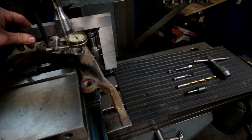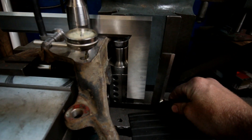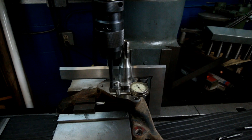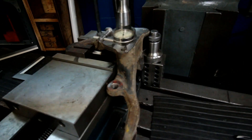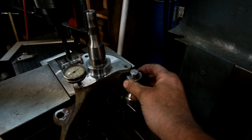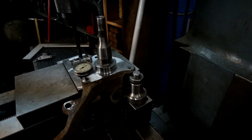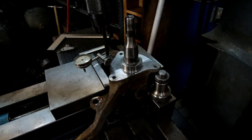Then I just leveled the tilt out, which was easy enough. I took this big machinist square and set it on that face, and I ran this square from the table face to that square and tapped this around until they were good. Then I did my fine-tuning with the dial indicator — I get about three thousandths total indicated runout. And just for safety since I'm going to be drilling, I put a little jack stand under here to stop any downward pressure. So we're all dialed in now and I need to pick up these holes so I can start drilling them out to the next size.